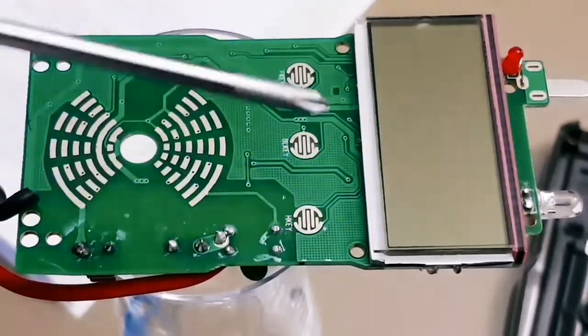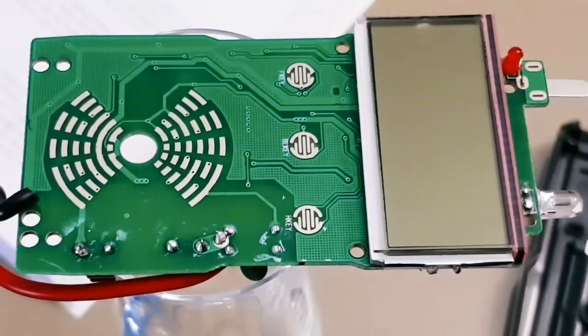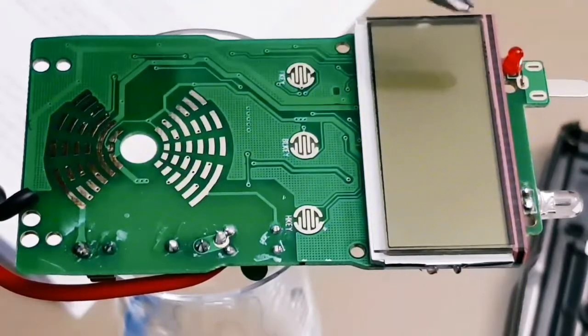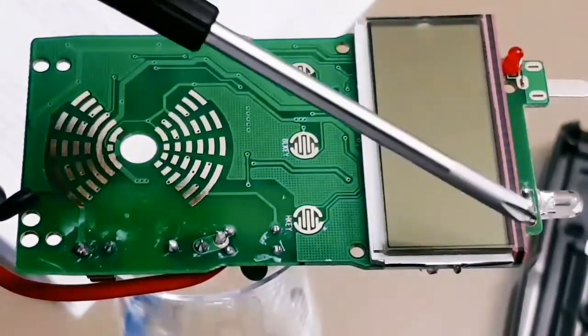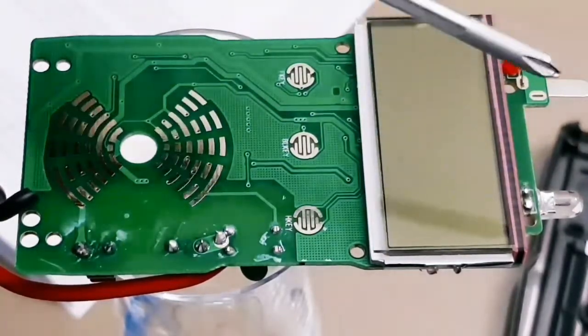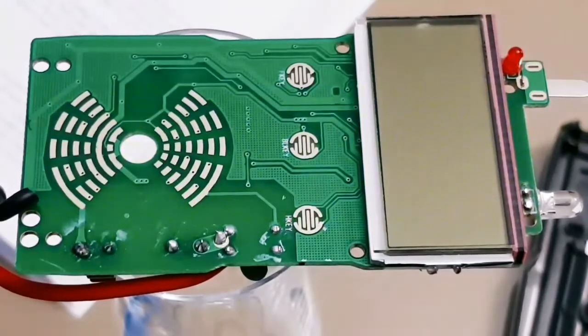There's our inputs, the LCD display, classic plastic elastomer. Whenever you're handling these, if you can, try not to touch the elastomer per se. If you happen to grab it accidentally or mangle it with your greasy fingers, it's always a good idea to take some 99% isopropyl alcohol, if you've got it, with a cotton swab, and just dab it clean, because they're quite easy to get dirty, and you want to make sure they're super clean, so they'll always have a nice clear crisp display.